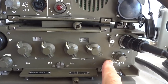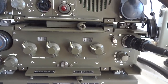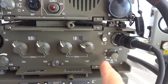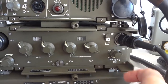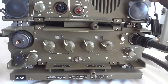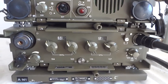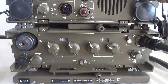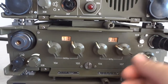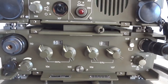This is a tone squelch — military tone squelch. Military uses a 150 hertz tone, which is not compatible with normal PL tones. But if you have a PRC-77, for instance, that uses the same tone squelch. The nice thing about this radio is that you can actually turn that off and go to normal carrier squelch — the PRC-77 cannot do that. There is also a mode where the discriminator filtering, pre-emphasis, and de-emphasis is turned off, for use with digital equipment like voice encryption and digital transmission. And this position makes the dial lights visible, so in ham mode you would use normal carrier squelch.